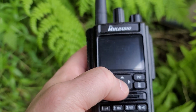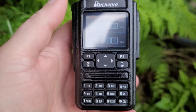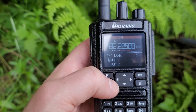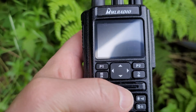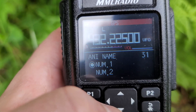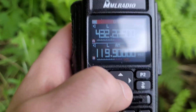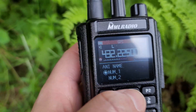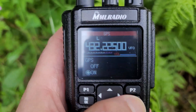I'll go through the menus you need to set on this radio. There are two things you need to make sure are set in the menu. Go to the menu by clicking the OK button, and the first one you need is menu number 31 — you can skip to it directly by hitting 31 on your keypad. You'll notice it has something labeled 'any name' — these are the IDs you set for the radios. Each one must be unique; I have this one set to num1 and the other set to num2. The second setting is number 50 — make sure your GPS is enabled.